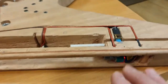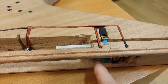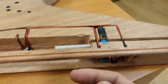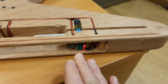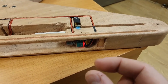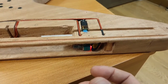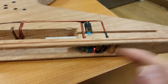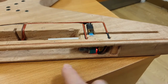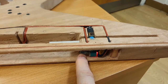Well, when we're dealing with what we're dealing with, it's not really speed of motors. The reason I put that in there is for torque. So obviously the more current I'm pushing through to the motor, the more pressure it will put on the syringe, which allows me to adjust the amount of pressure, because let's face it, we can try and measure out the individual pipette of how much water to mix up with the mixture, but the blood might be a different consistency depending on where I buy it from or how much I buy. There could be any number of factors, but I didn't want it to have so much torque that it would just squirt out if it was more watery, or have too much torque if it was a lot thicker and break the pipe. So what adjusting this potentiometer does is allow me to adjust the amount of pressure depending on the consistency of the blood.